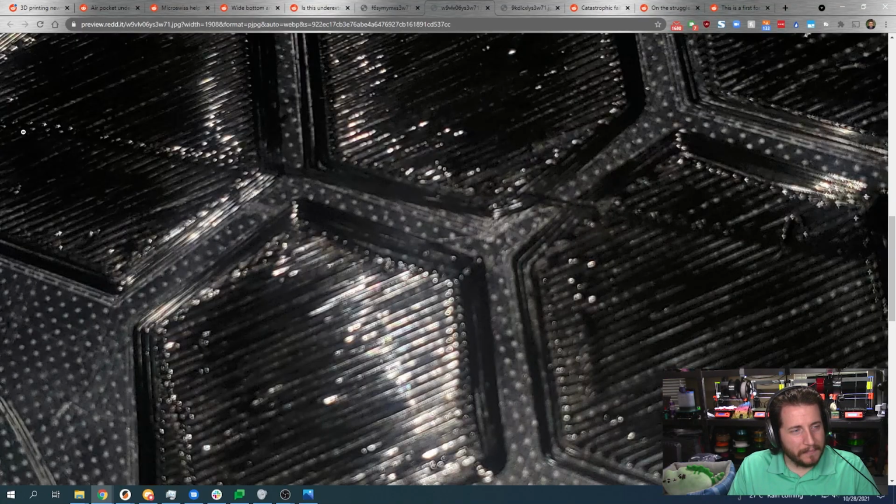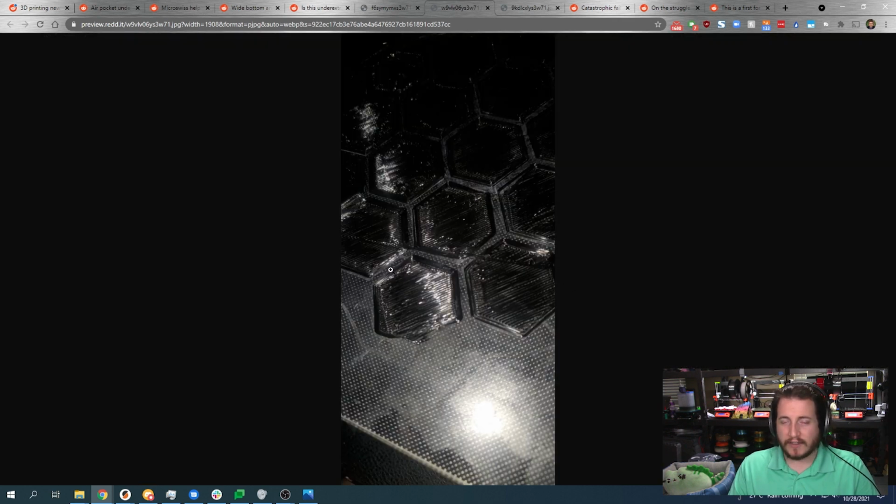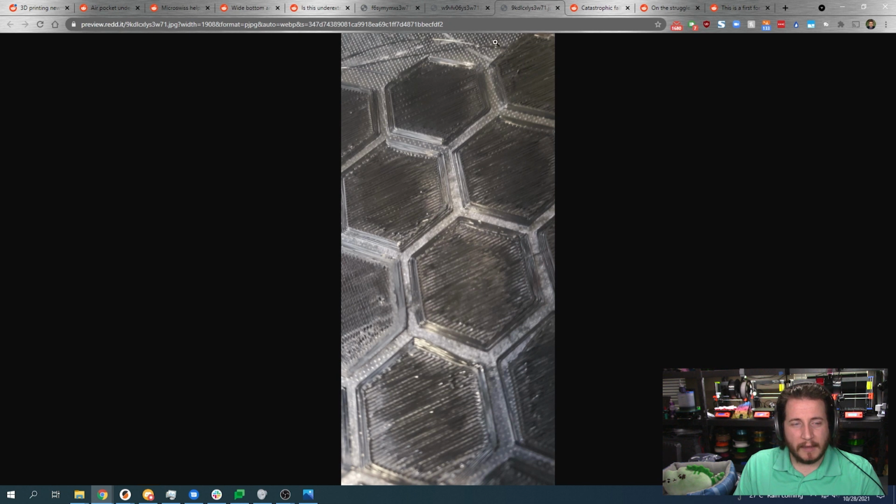And we can see a piece of plastic that's going all the way through the print. I assume that's a skirt or something like that around the print, or a purge line, something along those lines that didn't stick either, and the printer just printed over it. I think there's an adhesion promoter on the bed that's kind of giving them a bit of an unfair advantage here, and a bit of a red herring with what the problem actually is. Yeah, we can see there's a purge line skirt thing going around the print here, and that's not sticking either. You are not close enough to your bed. And that is my final answer.